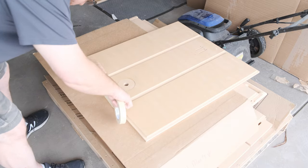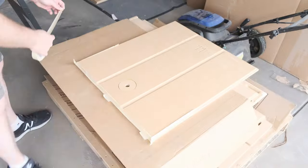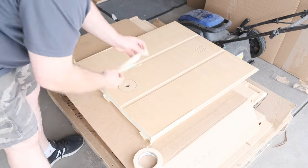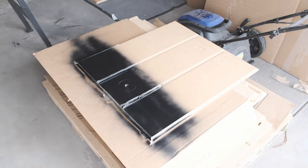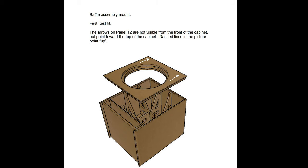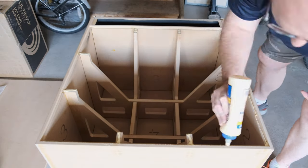As we look at paint, the rattle can paint is just some stuff I bought from Home Depot — you don't need anything special. The goal in this step is just to get black paint deep inside the port so that when people look inside it'll be dark. Once everything is assembled it's difficult to get paint far inside, so you want to do that painting before you finish assembling all the pieces.